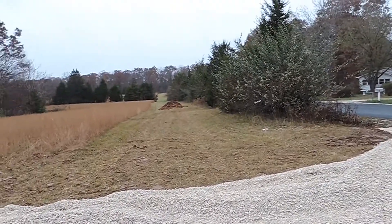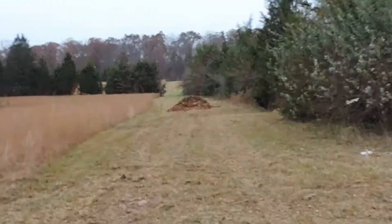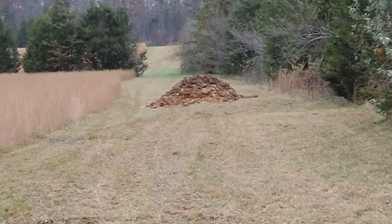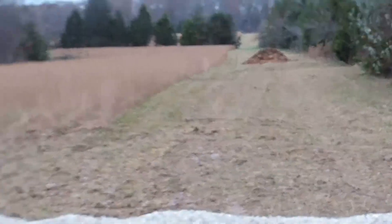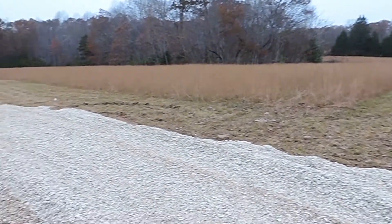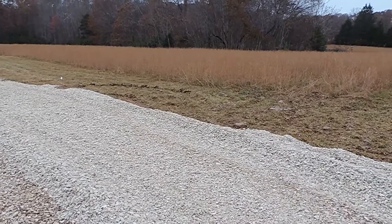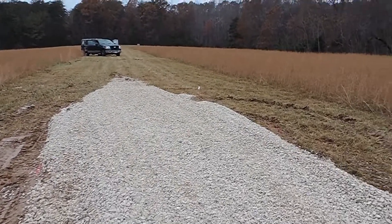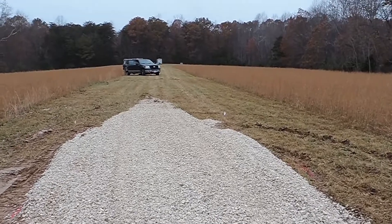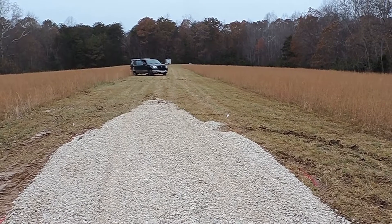Here's the entrance. There's the pile of dirt and topsoil that I took out of the area where I'm putting in gravel now, and this is two tractor trailer truck loads of gravel. I've got a 50-foot wide entrance and about a hundred feet of crush and run, which is about five inches thick overall.